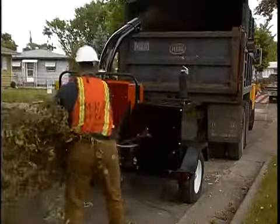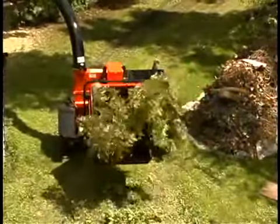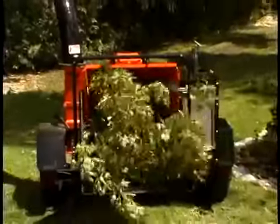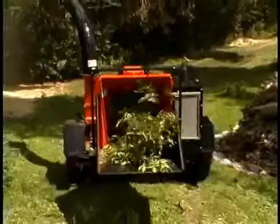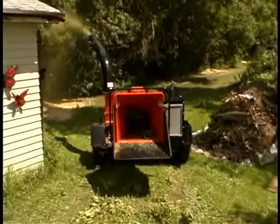The powerful engine is protected by a heavy duty enclosure, and all models include an electric starter. They come standard with a hydraulic feed system and a feed sensor, which controls the rate that limbs are being fed into the chamber, keeping the disc speed at its best operation. If your operation requires tremendous chipping power, one of these 9 inch models will work for you.